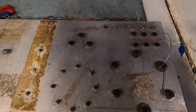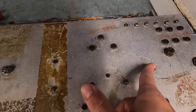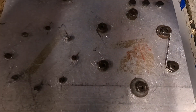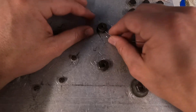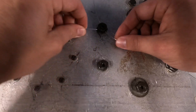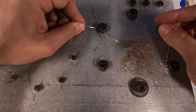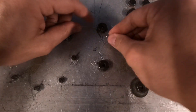I'm going to get this in there best I can. I'm going to try to set it up on the tripod and then film how I'm going to use the cross method. I'm actually going to go through the bolt, around, and then back through the bolt again through the center since it has holes on all sides and not just a hole on one side. You see how this side is just coming around one time. I've got quite a lot of extra wire because I'm doing it by hand this time and not with the pliers. First I'm going to go through the bolt about halfway with my wire, and then turn around and come right back through this way. It doesn't really matter if it goes under the top or over the bottom of that other wire, just so long as it goes through the head of the bolt.